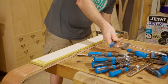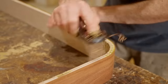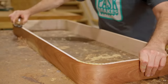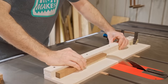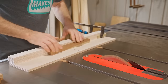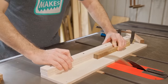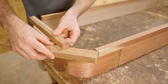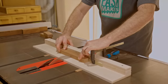That seemed to go pretty well, which I wasn't super confident about, and next I planed off the excess. Now that the sides are done, I need to add some trim onto the top and bottom, and I'll use this black wattle that I milled off-camera. I've got some wider pieces for the corners, and I'll cut those next. All of the trim is oversized and will get trimmed back later on after it's been fitted to the sides of the case.